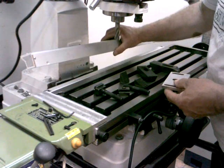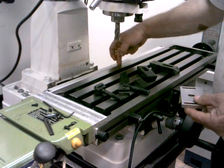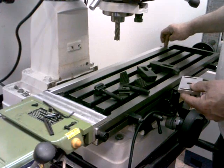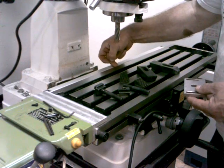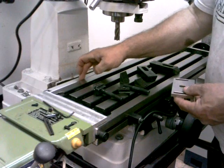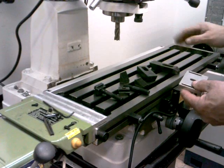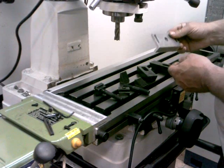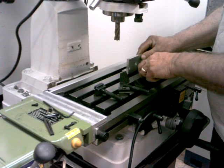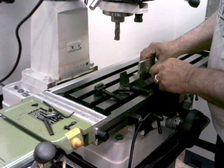This is the cover that goes over the scale. This is the scale itself. In behind that there's a solid mounting piece that actually bolts to the side of the table, and then the scale bolts to that mounting piece. You can adjust this mounting piece up and down and side to side so that you can get it true. I'll show you how I did that because I'm going to take it all back off to Loctite the bolts. But before I do that I need to mill this down a little bit.